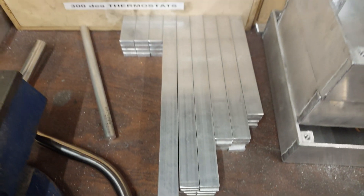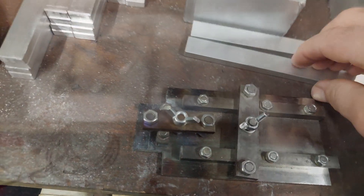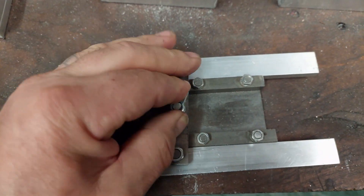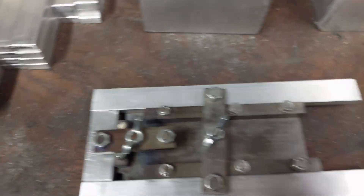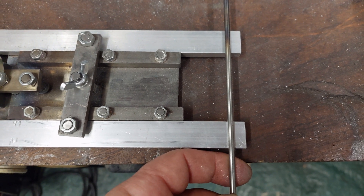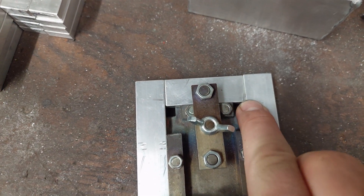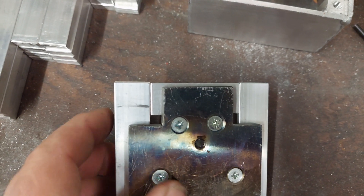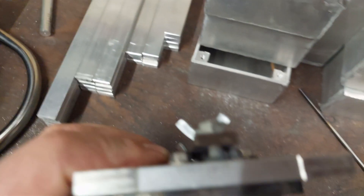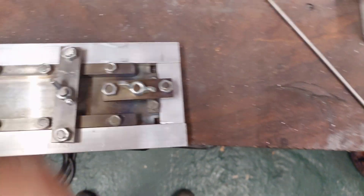Moving along, I've got some pieces ready cut to make some long reach clamps — they need to be drilled yet to accept the screws. They're assembled in this jig, so these three pieces are held in the jig like that. Once they're drilled — because I weld them after drilling — steel rod is put through the drillings to ensure the holes align, then it's clamped down. The jig is constructed so I can weld this joint, then this joint, flip over and weld the other side, weld the ends, and then pop it out of the jig and do a fillet on the inside corners.